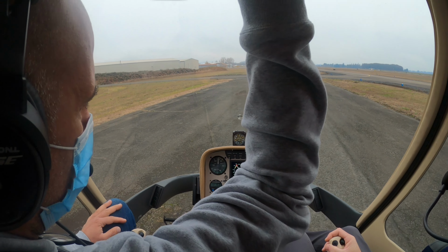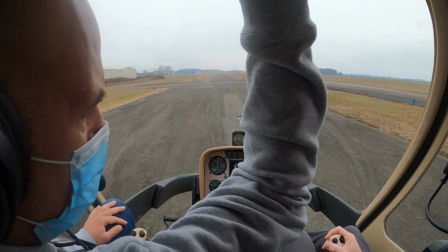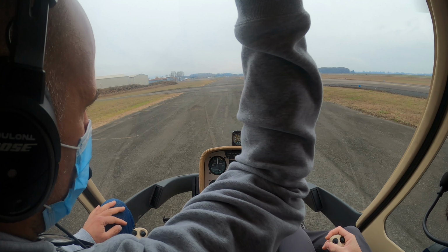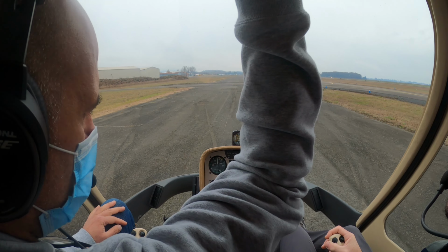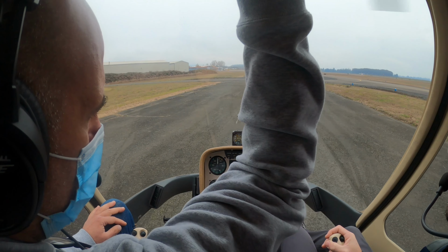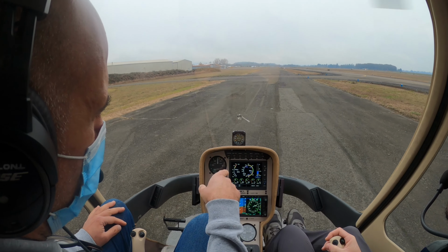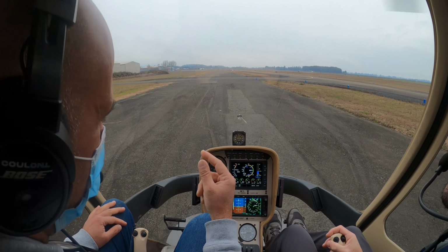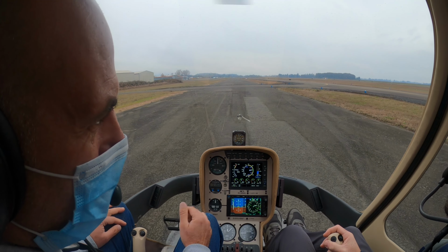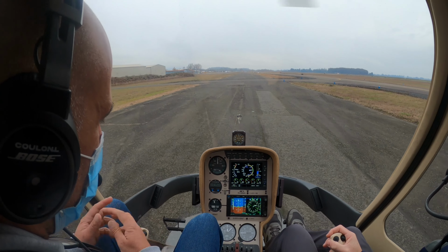So you see we need 20% more. Yeah. And vibration. So now I switch off the magneto, okay? So you see we feel some vibration, you need 8 or 10% more. Oh yeah, but it's not a big difference. But this magneto is very bad. On this one, usually you lose 15%, on this one you lose 20. Okay.